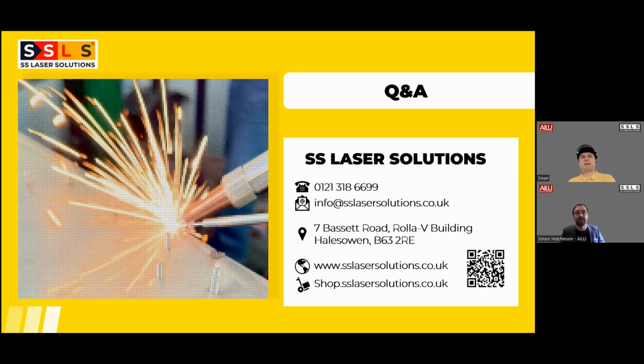With the laser welding, as I said, on the gas section, we use the gas also to protect the optics. Not all laser welding machines use the same mentality, because the gas is going to be purged from the torch towards the material. So that will prevent any contamination from getting inside. I think we can't say any, but less.